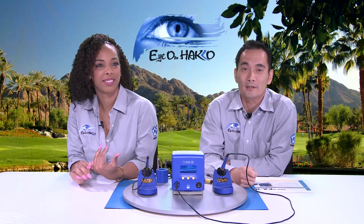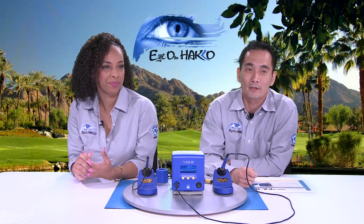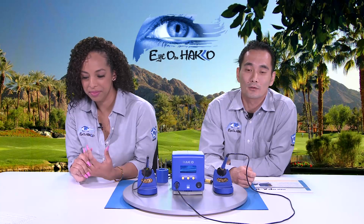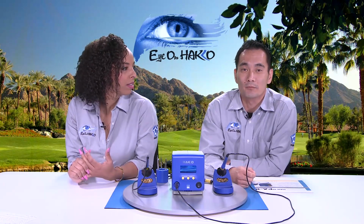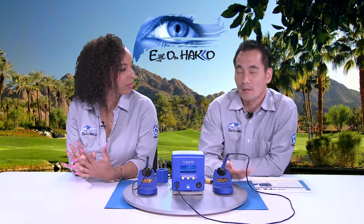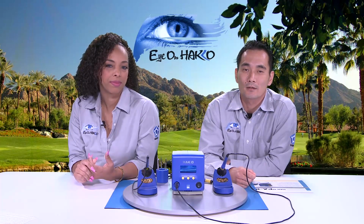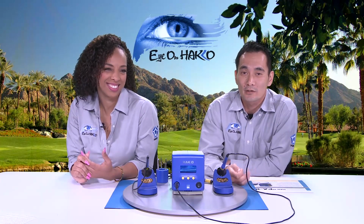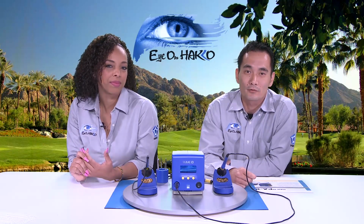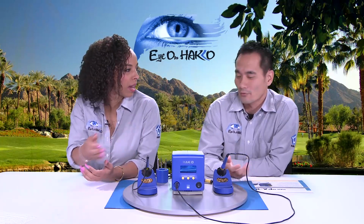And there are some additional features on the station itself, like the auto shutoff, which is a good safety feature to have. The sleep mode can help reduce oxidation on your soldering iron tip and also preserve tip life, because sleep mode drops the tip temperature down. You also have password lockout, which can prevent any unauthorized setting changes to your station. So those are some of the added features of the station, and we'll go over some more later on. A little bit later I'll also go through the operation.